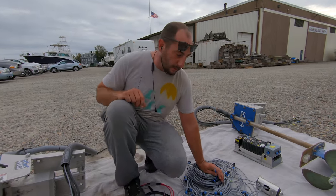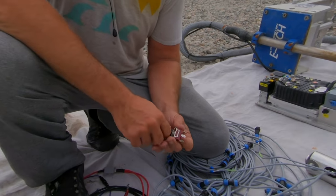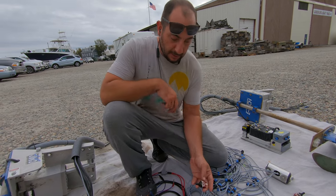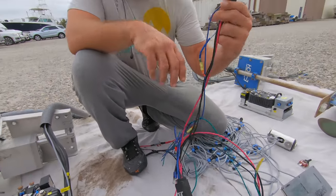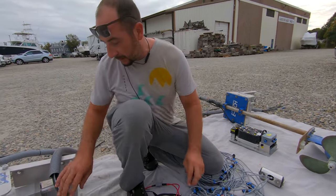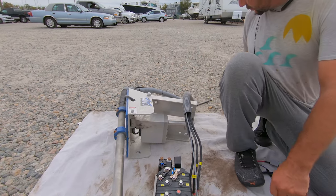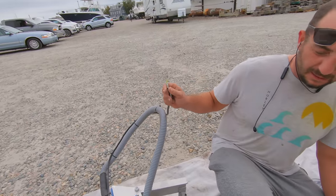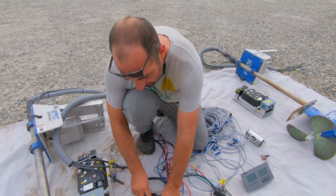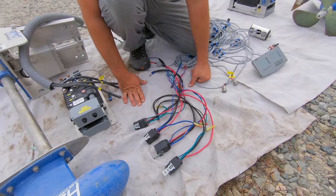You can put them to a switch or you can put them to a button. These guys here are DPDT switches — double-pole double-throw — and they're momentary switches that run these relays. So the switch controls the relay, and then the relay controls the tilt. Those relays end up controlling these guys here. It's not the way I would have set it up, but basically these act as reversing relays. It's a little complex and you'll need to experiment with it a little bit.